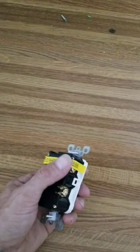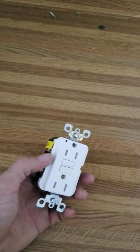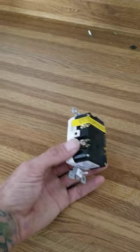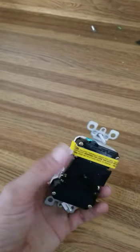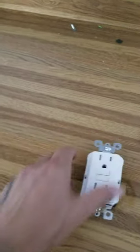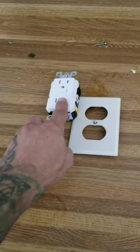This terminal right here — it comes right out of the box with this yellow thing. This is NOT for splitting. You cannot split a GFCI. I'm not necessarily a super professional but definitely take my advice on this one. This yellow tab is for jumping to another receptacle so you can run multiple receptacles off of this.